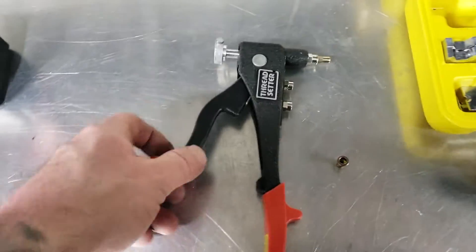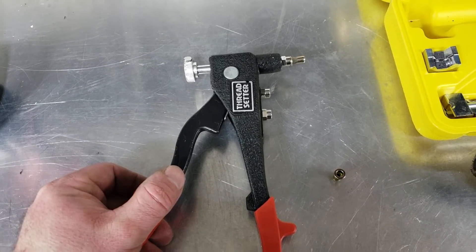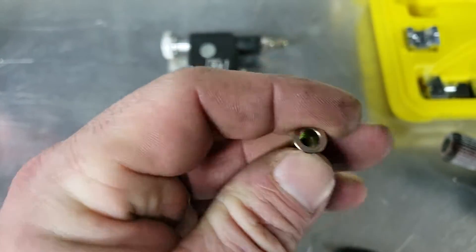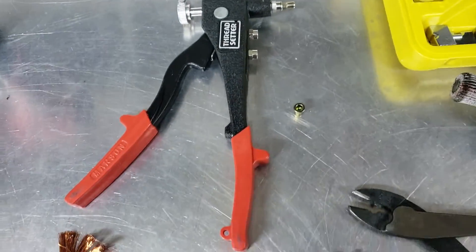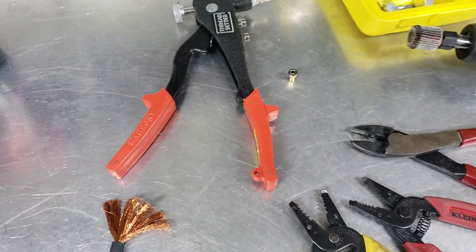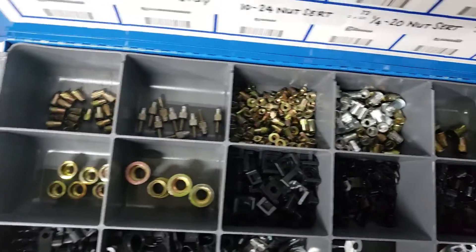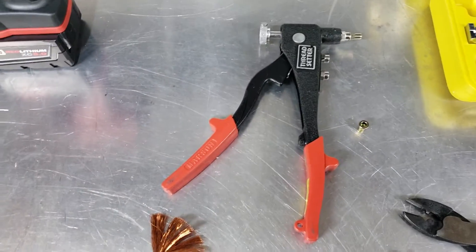This is something that's been around forever, and I think most of y'all don't know what it is — it's a nutsert tool. See this thing? It's threaded. This is a 10-24 size, but they come in a lot of different threads. You drill a hole, squeeze it, and now you have threads — so you can use a bolt as opposed to a self-tapping screw, which is crap. They come in a whole bunch of different sizes, all the way up to half inch. Amazon will probably be your answer for them, or I buy them from McMaster-Carr — a little cheaper there, and I buy them in big quantities.